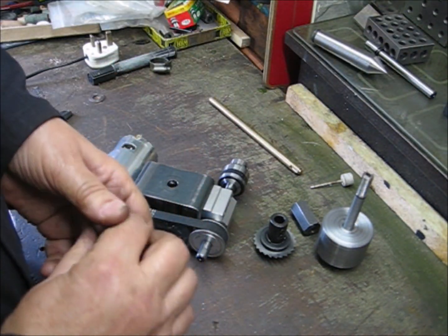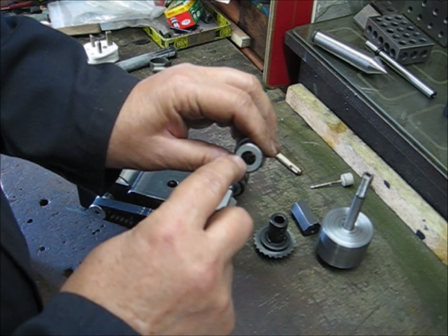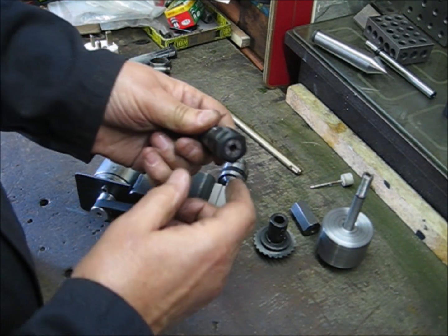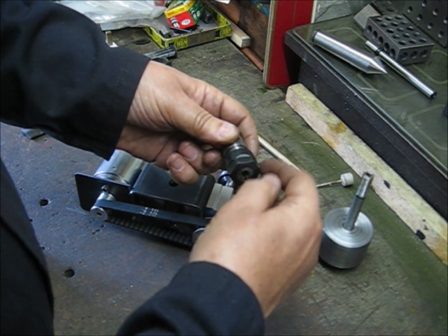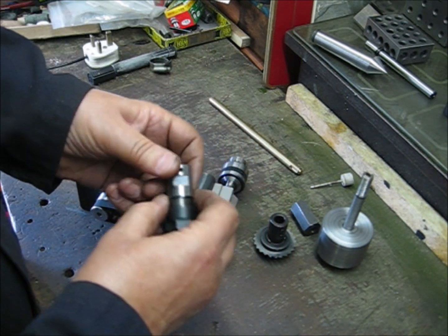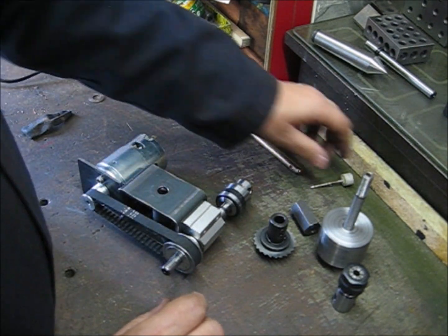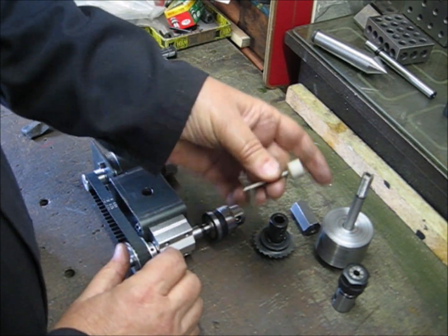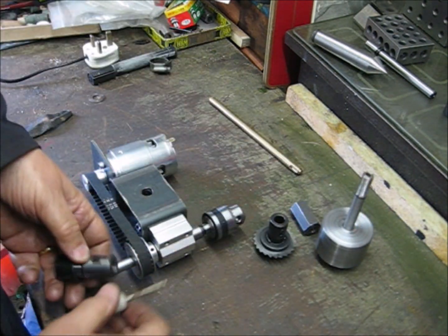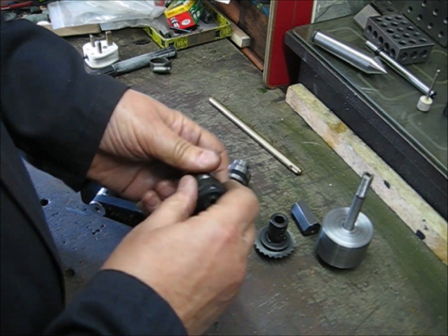Another adaptation I've done is I've bought an ER-16 collet holder. The bore at the back is 8mm and the diameter of the shaft is 10mm, so what I did is I chucked it up, set it up in the lathe, clocked it true on the taper inside the bore, and then drilled it out and reamed it. It's quite tough stuff but it machined quite well. You can use it for grinding with different points, either holding the chuck or in the ER-16, and you can also use the ER-16 for holding slot drills and mills.